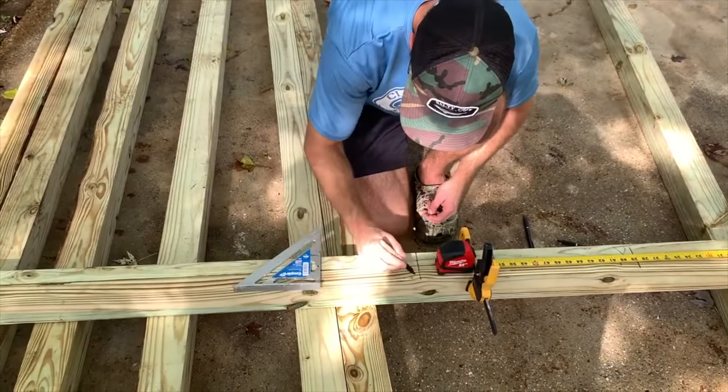So this is the Clear 100 Epoxy Part A that we're gonna mix our pigments into. So we're gonna open that up. That's 3 gallons right there. Here's what we're looking at, just completely plain. Now we'll go ahead and add our pigments. So at this point, we're gonna put 8 ounces of this great white pigment into the Part A epoxy, and then we're gonna put in an additional 4 ounces of pearl.